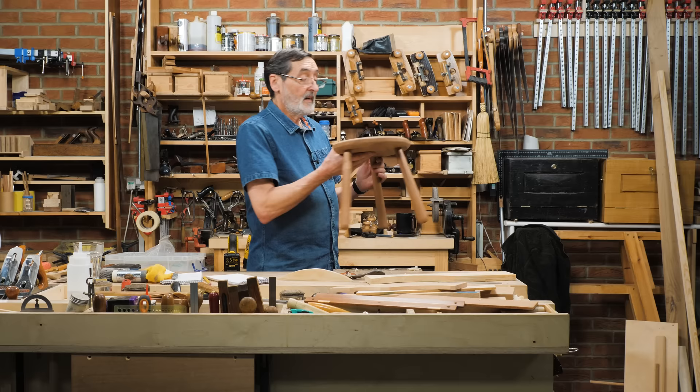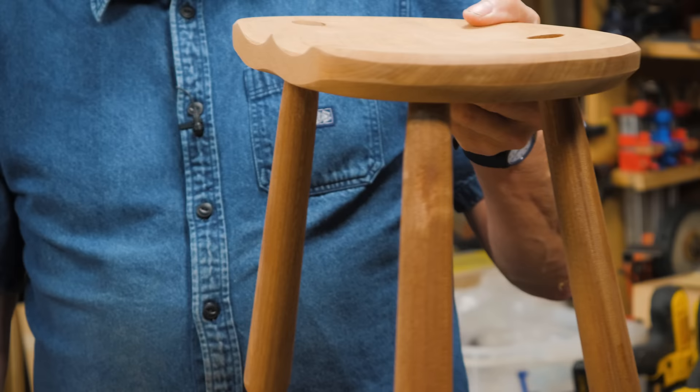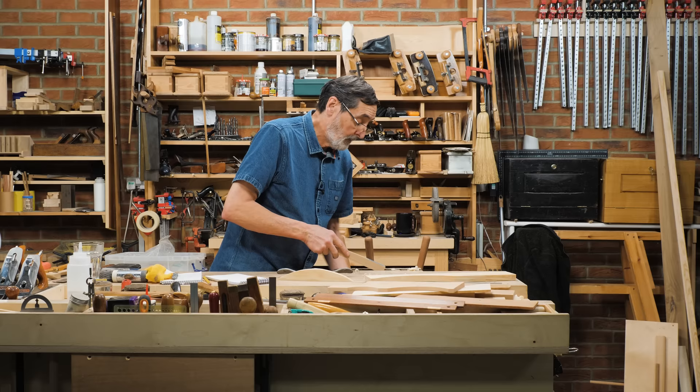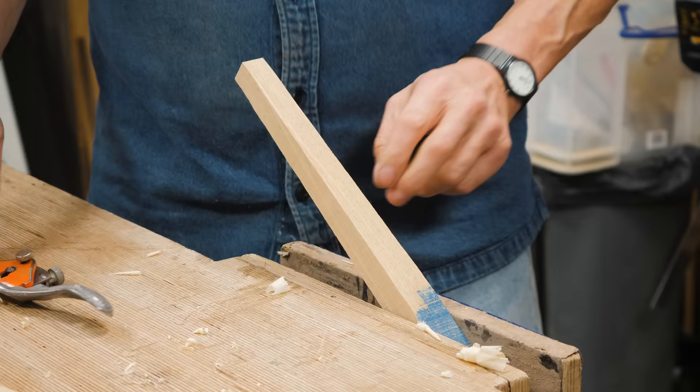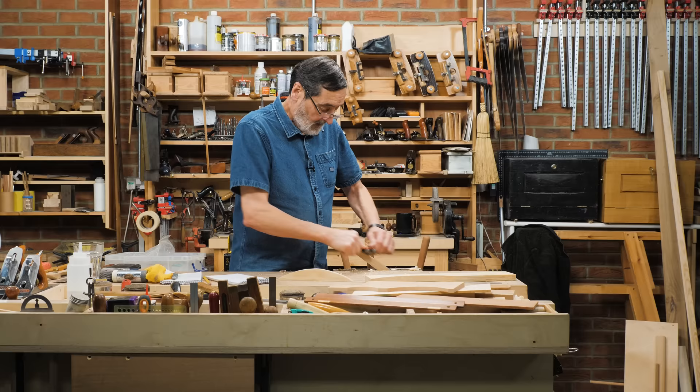Take a look at this stool I'm in the process of making. I shaped all the legs, shaped the curves, even some of the hollows, using a flat bottom spokeshave to get all these bevels and shaping done. Even the legs — when you put a stick in the vise, it's got a taper just like those legs. I just offer the spokeshave at 45 degrees and work up the leg like this. Don't be under the illusion that this tool is no good — it's a brilliant tool.